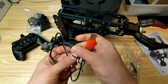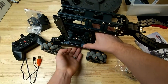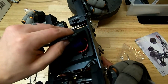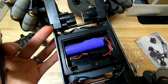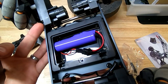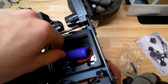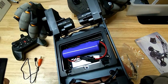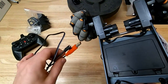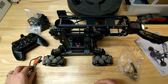This is the charging cable for the battery that goes into the machine — pulls out the bottom. So it's a 3.7 volt 18650 cell with a proprietary wrap on it. There's some kind of connector — I don't know if that's a JST connector or not — it looks like the power source was a bit of an afterthought the way it fits in there, but it's fine. You just plug this into a USB source and you can charge it up.